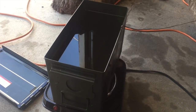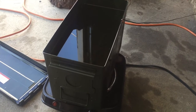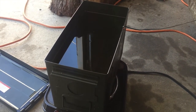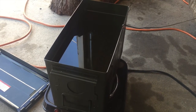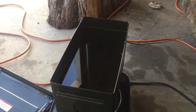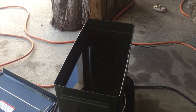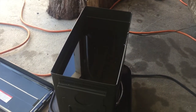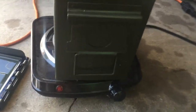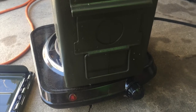This is my quench tank — it's out of an old ammo can. The oil I'm using is canola oil. A lot of people have trouble with it because they don't know exactly how to quench properly in it. What you need to do is heat it up to about 135 degrees. The more precision you have the better. I use a hot plate to heat the oil, which creates convection in the oil and evenly distributes the heat.